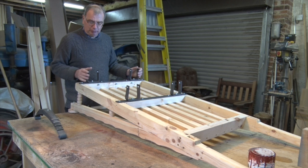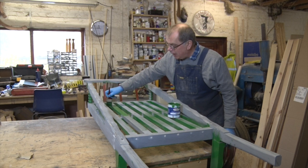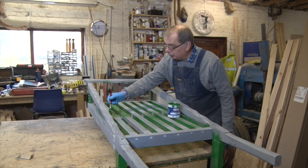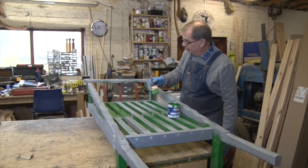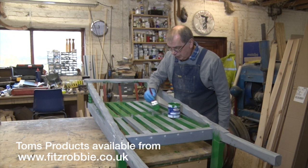What I'm going to do now is a bit of painting - nothing very exciting. I'm just going to get some primer on all these bits of steel, and then I'm going to fill in the screw holes and things, and then we're starting to look towards the end. Now I'm using a special paint - it's an enamel paint, specially made for vintage cars, steam engines, that sort of stuff. It's a high gloss enamel paint, so it's not the sort of thing you'd be putting on your walls at home. But it's just a slow process - put on a layer, and then ever so gently start rubbing it down. I'm using very, very fine sandpaper.